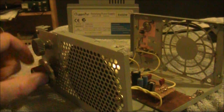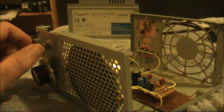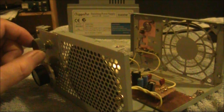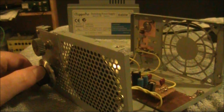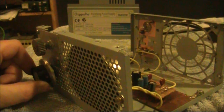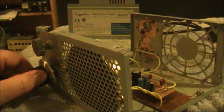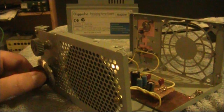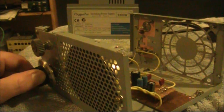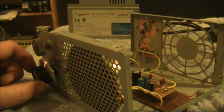This is horrible oscillation so I've got to wind it back. What we'll do is set it at the point before it squeals on our lowest frequency of around 7.025 or a bit below, and we'll tune up. This brings us back up to about 7.135, so we've covered over 100 kHz of the band with no touching of the regeneration control.